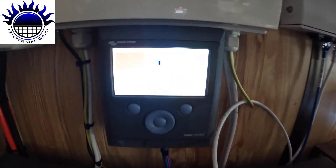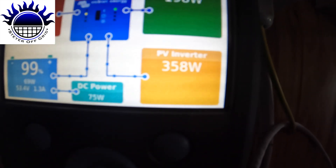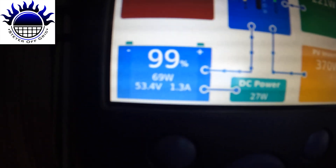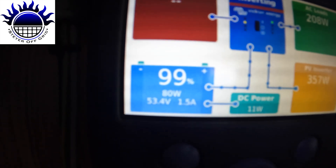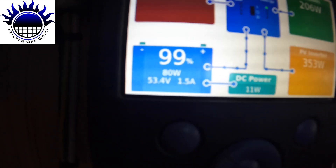This meter tells me what's happening. At the moment we've got 360 watts coming in — that's because it's overcast and slightly raining. The panels will produce about 3,000 watts; it was running 3,000 watts this morning. That's going through the inverter, and then out of that is 211 watts — that's all my loads: just the fridge, the incubator, and periodically the computer. The battery down here is at 99%. Last night it was only at 71% because the system was on and off all day, and in the morning it was at 61% — so it doesn't use much power overnight.